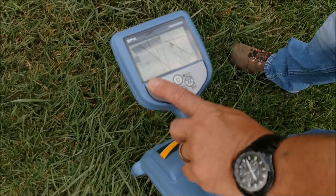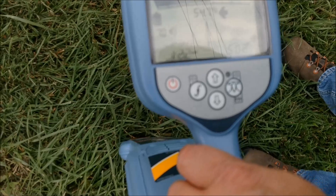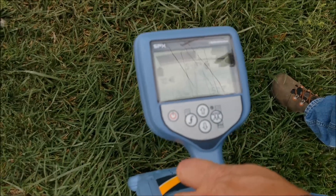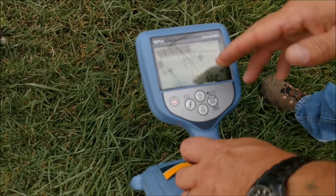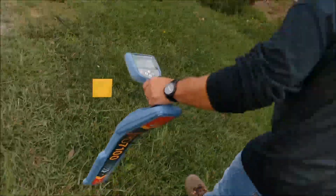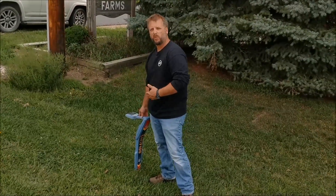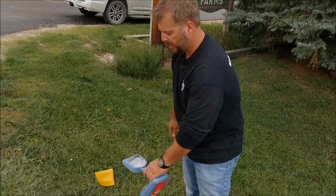Our milliamp reading is found on the left side. We're pushing out 20 milliamps and we're picking up 12 out of those 20 — that's another verification that you're on the right line. If it was only saying two milliamps, it could possibly be a telephone line or something else we've bled off to. You want that to get relatively close to what the transmitter is pushing out. If we were picking up two signals, the best thing to do is measure your milliamps on both of them — whichever one reads higher in milliamps is your target line, the one you want to paint out.